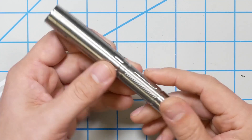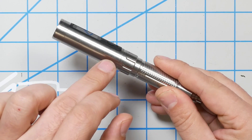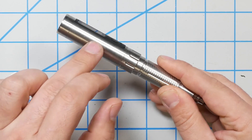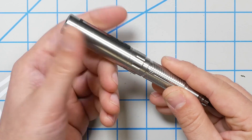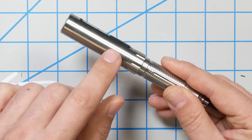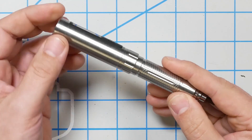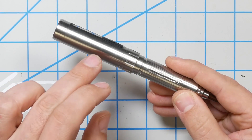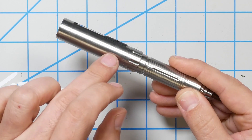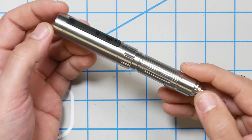This is just a little battery-powered screwdriver — I grabbed it as an example — but if a positive wire inside the device were to come in contact with the case, then the case would be energized and if you touched it you would get a shock. It's just a little three-volt device, nothing serious, but especially if it's higher voltage or mains power, that's a concern. So the case is always grounded so that if a live wire comes into contact with it, the current is shunted to ground and the case doesn't become energized. You get a short circuit, and that's better than shocking yourself.